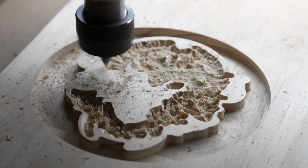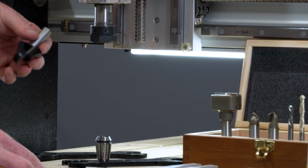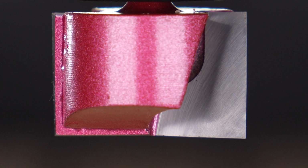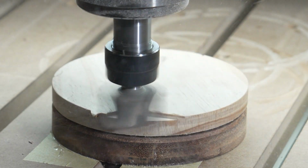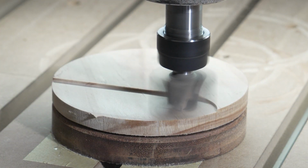One last cutting tool that you shouldn't leave out of your inventory is a large surfacing bit. You can see with this cutting tool, again it has 2 wings, but it's a very large diameter, and this is used for surfacing any material and or your spoil board.